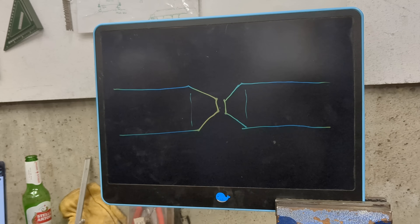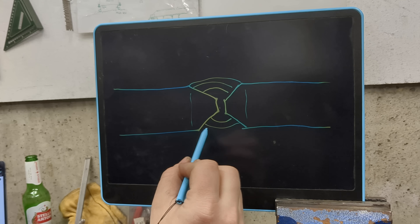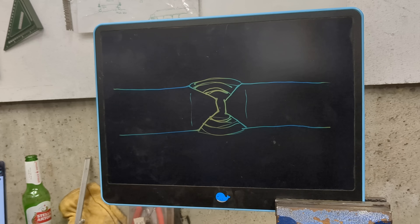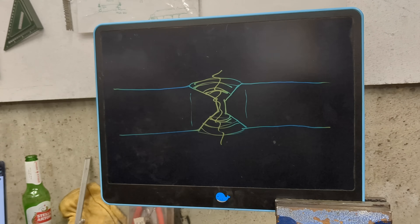While I'm not classically trained in machining or welding, it seems the traditional method of joining two shafts is to butt them up with a generous bevel on both sides so you can get multiple passes with the welder — a root pass and then a couple of filler passes. That's the advice I got from online, from the welding subreddit. But unless you're doing proper preheat and post-heat treatments and using a massive TIG welder with a structural welding filler rod, I don't think it would be very strong. With my little MIG welder, it would break so fast — a crack would form through the weld and the shaft would be in two pieces.